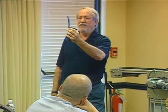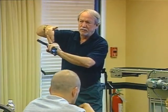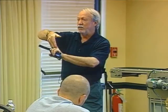With all of that power that's being transmitted through multiple belts on these paper making pieces of equipment, you might take a thick belt like that, 5 millimeter, sometimes more on the thickness of the nylon, and you might have to stretch that belt or pull it 10 to 12 inches to put the splice in before you're going to be transmitting the power necessary to power that equipment. Now, stretching a belt that thick, that much, you're probably in the neighborhood of 4,000 to 5,000 pounds of pressure that you're pulling that belt to get that to stick together and transmit that power. That's a lot. Very dangerous installation, to say the least.